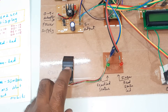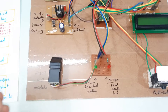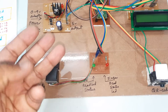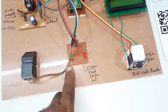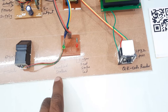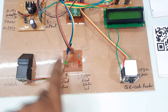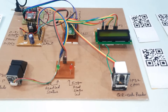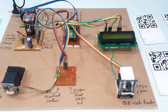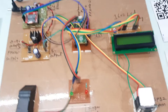The Raspberry Pi Pico RP2040 drives a 16x2 LCD display, which shows whatever process is currently running. The R307 fingerprint module has four fingers pre-loaded using SFG software, and there are four QR code cards. The red LED indicates finger scan status and the green LED indicates QR code status. The QR code reader module reads the QR code and sends the data to the Raspberry Pi Pico.